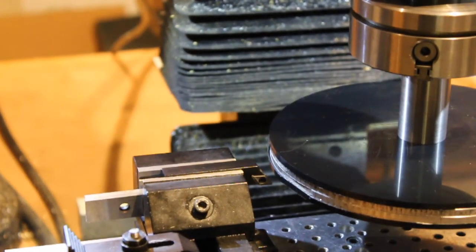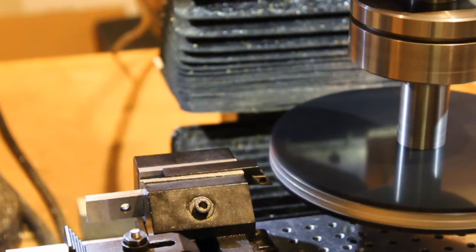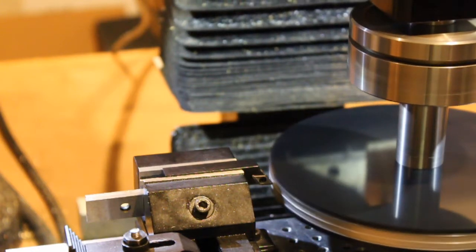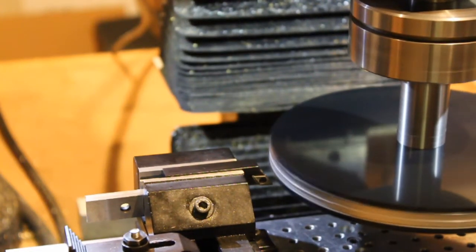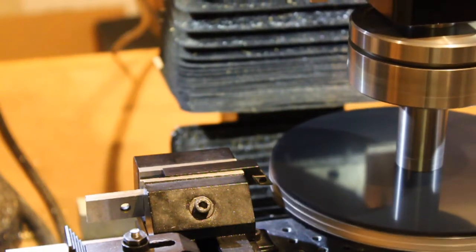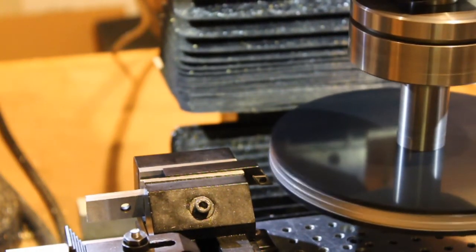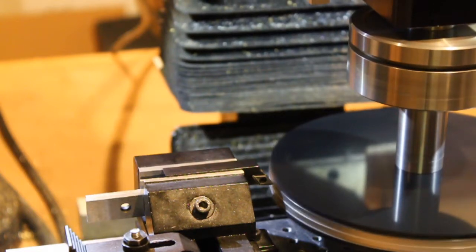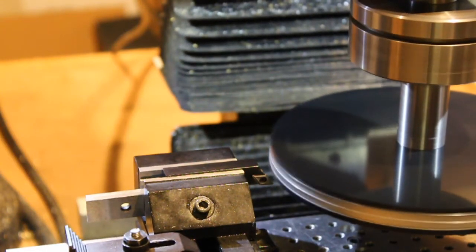Let's see how it works. Just like when I did this on the lathe, you have to cut air in the beginning because the blanks were cut on a bandsaw — they're certainly not perfectly round. So you don't want to be making too aggressive a cut coming into it, but it's just now beginning to cut.